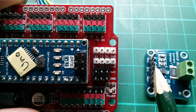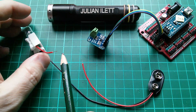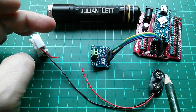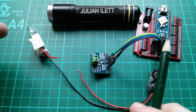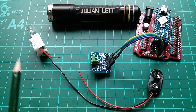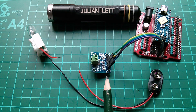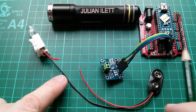The UNO goes VCC, ground, SCL, SDA — so that's two swaps. I've cut a break in the positive side of my power supply and load, and I'm going to put both those positive leads through the sense resistor — the battery on V plus and the load on V minus — so we should get positive current readings. For the moment I'm not going to reference the negative side to Arduino ground; I want to see what happens without that connection, whether there's an internal connection in the chip or if I need an external one.